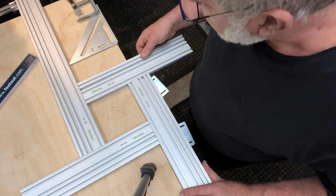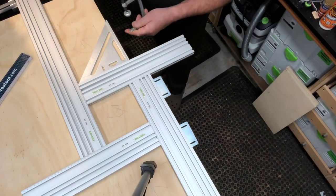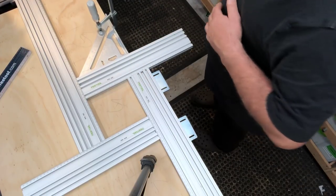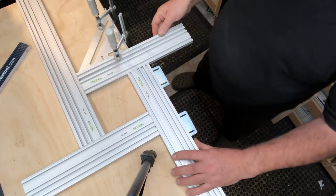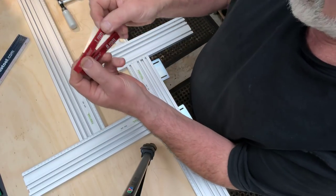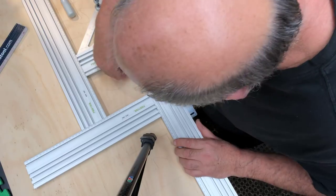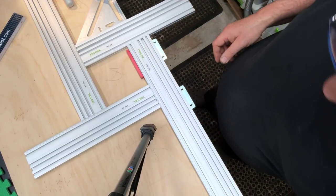Now I've got a perfect little square area because I've got 143mm this way and 143mm that way. To set this up I set the set square here and clamp it down to make it nice and square. Then I push this side of the rail up against the square to keep it nice and snug, then grab another clamp and clamp it over here temporarily. I use these 1mm and 8mm spacers from Woodpecker because I want 9 millimetres.